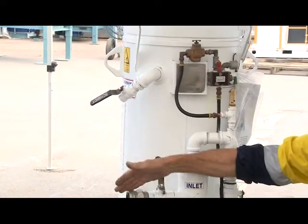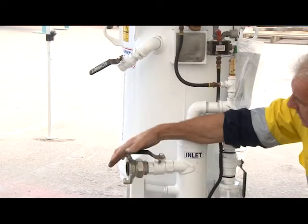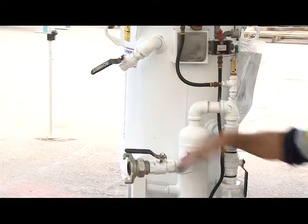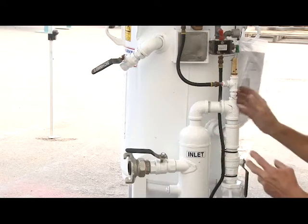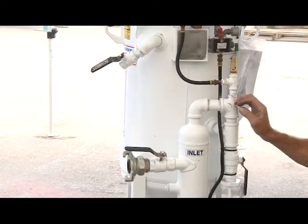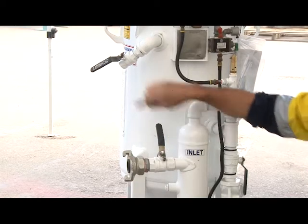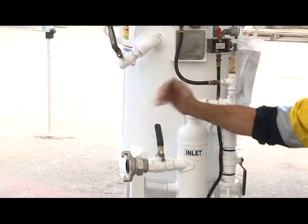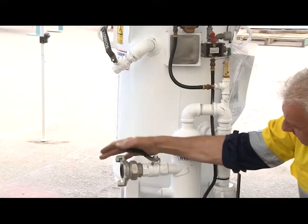So therefore what would happen if I put air on this particular line and open this valve, it immediately starts to exhaust, which is an indication to me that I've got air but the pot's going to exhaust. So that means I have a pot that's positive, it's got air in it, it's ready to go. So before we turn that air valve on, we make sure we close this valve. Make sure the air's right, the coupling's right, the pins are in. Then we open this valve.